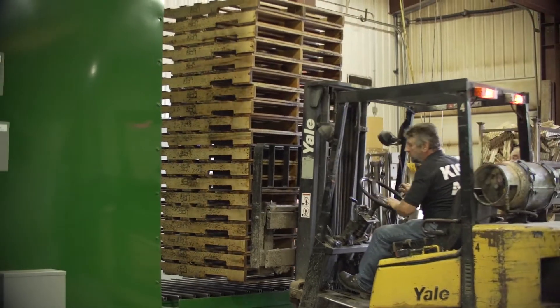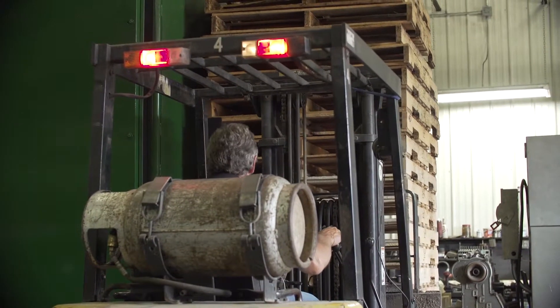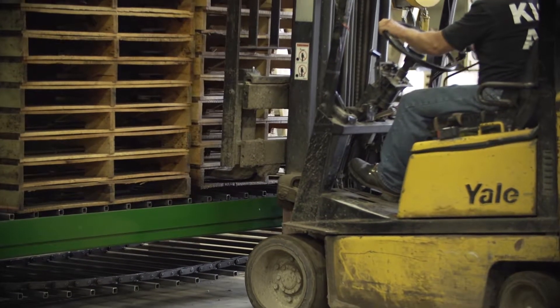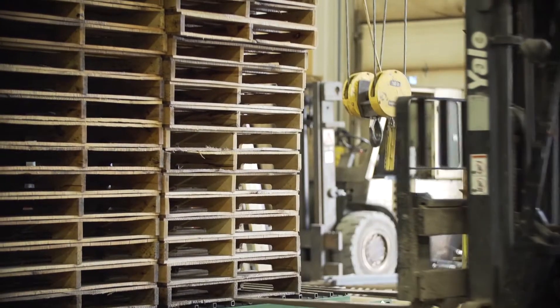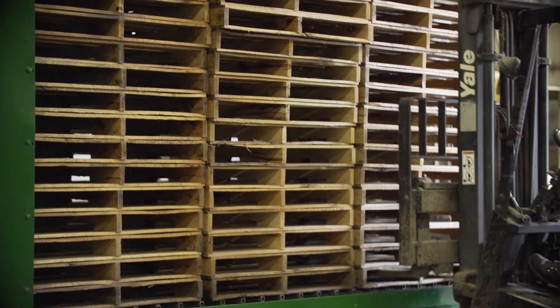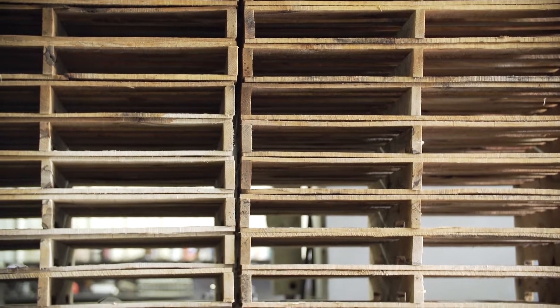White and Company President Marshall White, in conjunction with the Virginia Tech Center for Packaging and Unit Load Design, engaged to conduct testing on April 27, 2017, focusing on sterilization for mold prevention. GMA-sized pallets of two species of wood were the scope of the testing. Specimens were removed from untreated pallets and forwarded to Virginia Tech and initial moisture content was calculated. Stacks of pallets were treated for 1, 1.5, and 2 hours of each species.